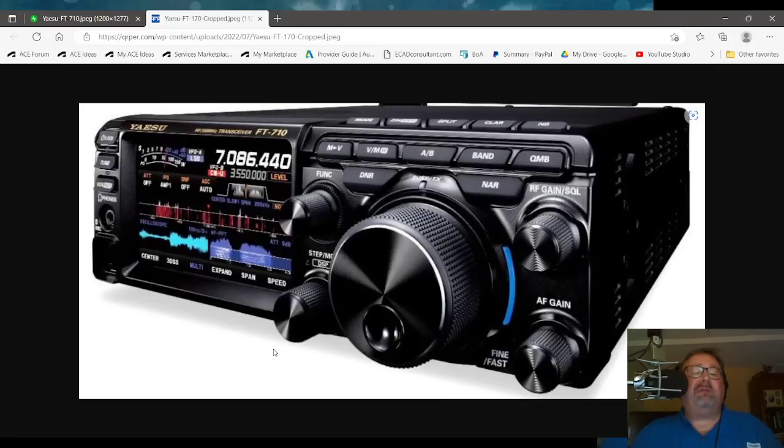Step is incremental tuning. MCH is cycling through your memory channels if you've programmed some in. Remember, Yaesu programs the 60-meter channels already — they're in the memory. If you click V/M and go into memory mode and turn that knob, you will eventually see memory bank five. Most Yaesu radios will come with 7 MHz programmed into memory one, then memory bank five for the 60-meter channels — it's up to you to program any more. So this knob would cycle you through those memories, and maybe it also serves a double purpose for DSP.